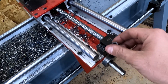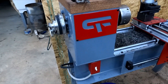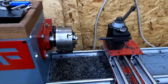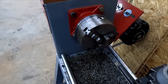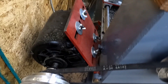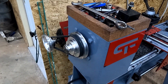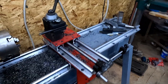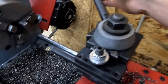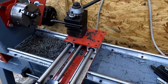We made some little handles and put them on. I got to put smaller bolts in it — that's just what I had here in the shop. Instead of a warning label I just used that as another advertisement point. We put this little tray up here so we can still get inside if we ever need to change anything. Ended up changing the jaws back to the inside jaws — those work pretty good. We've got it wired with the switch down here. We just swiveled the plate off a little half-inch bolt — the motor tension does pretty dang good, and it's quick and easy to change gears. We didn't end up staying with the old tool rest — a neighbor guy who's a machinist found one at work and asked if I could use it, so we put it to use.